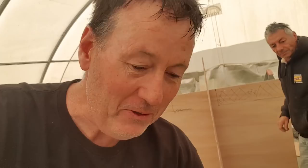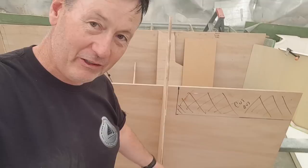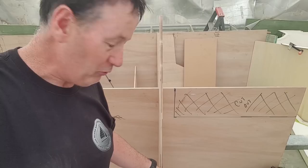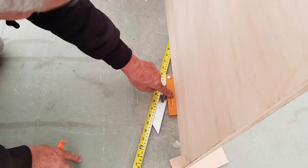We've had a good hour and a half of working out here. Johnny had the string line out and we've got it sorted — and you know how much Johnny loves his string line — but down here we're working out this intersecting bulkhead. Johnny's down here with a sliding bevel, working out the angle we need to cut this main bulkhead to allow for this one to intersect through. That's going to be like probably 20mm.